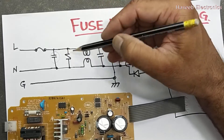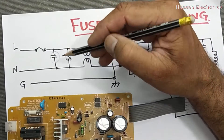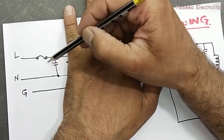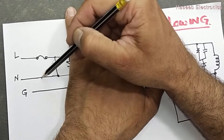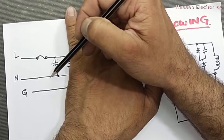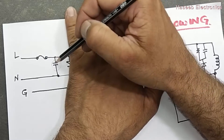After the first component, we have a MOV — Metal Oxide Varistor — which is in parallel. It is a protection device. Sometimes if any high frequency spike comes in, it will make a short circuit — it will give the easiest path for maximum current to flow, and so the fuse will burn out. We have to check this capacitor and the MOV.